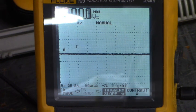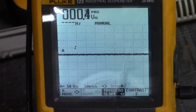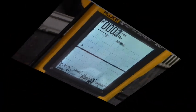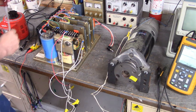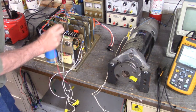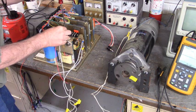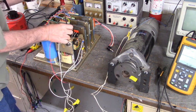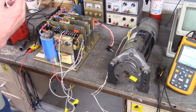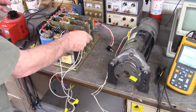Let's power down. I'll show you what happens if we get the armature or the tach backwards from each other. I'm going to reverse the armature wires and we'll watch the motor run away. If you get the armature wires backwards from the tach wires, this motor will have no speed control — it will run away. I won't be able to control it with that speed potentiometer.